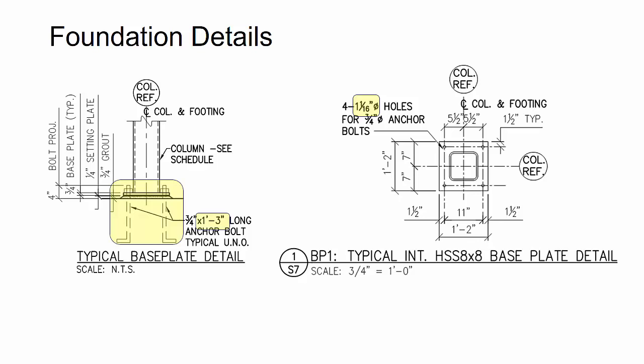when you start going bigger than these diameters, you have to start looking at whether or not you're going to use plate washers there. And then sometimes those plate washers actually have to be welded to the top of the base plate. If you start adding plate washers there to cover those oversized holes, then what starts to happen is maybe the actual spread and spacing on the anchor bolt starts to increase, which then impacts the design. So these are really important things to make sure you understand and get clarified with the fabricator, and just kind of let them know exactly what you're doing and see if that fits what they want in the field.